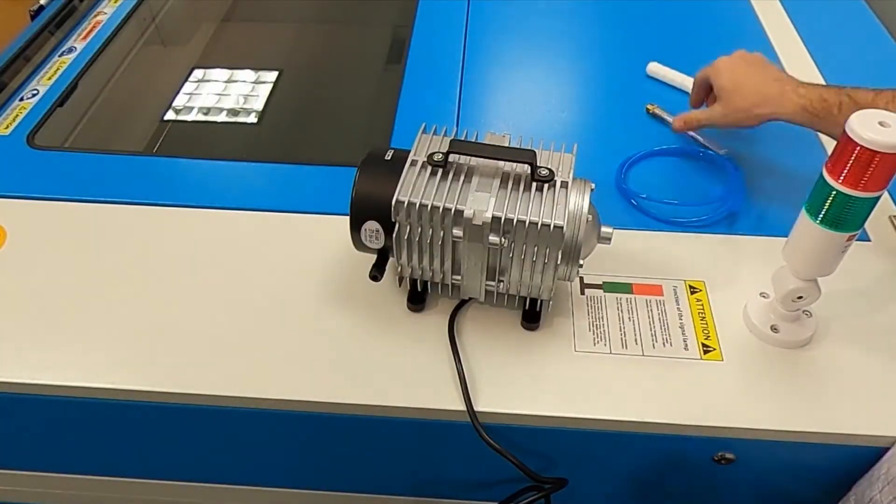So what is so great about dual air control? Most lasers come with an air pump like this that is routed through the nozzle at the lens. The airflow is necessary to keep the soot and debris from collecting on the lens, but it also assists in the etching and more importantly in the cutting process.